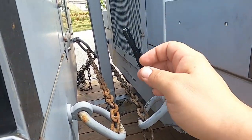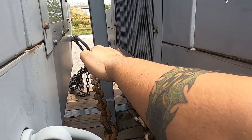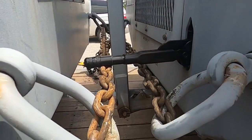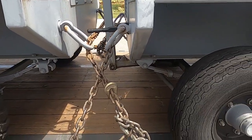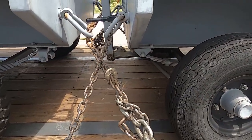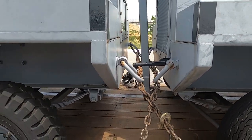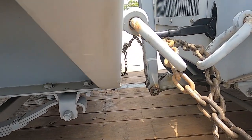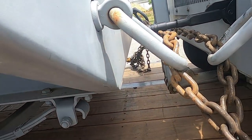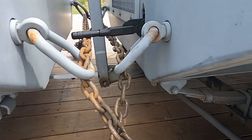This was starting to crawl forward — this should actually be down just like that. And the chain that it's laying on, when that starts bouncing, just threw it right back up. It's spring loaded. So that was the issue I was having — it was all because of the cross chain. It had actually almost walked itself up about a foot. So we can go ahead and change that up and I'm going to have these pull on the inside. I like having them pull to the inside anyway.